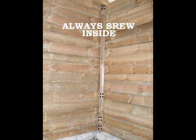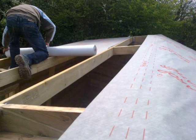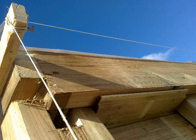Here you can see the apex sitting on top of the post, as well as your barge rail for roof flashing. Once again, it is advisable to use a breathable membrane to avoid condensation. When fixing your roof cover, temporarily attach pieces of timber onto either end of your apex. Onto these temporary timbers, attach a plumb line approximately 3 inches away from the side of the structure. This will ensure that your roof sheeting is in a straight line for the length of the building.